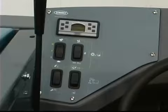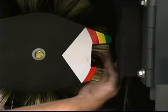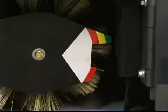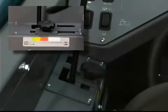To activate the main brush, lower the main brush lever to the working position. To deactivate the main brush, raise the main brush lever to the up and locked position. The main brush idler plug has a brush wear indicator used to determine the amount of main brush remaining — replace the main brush when indicated. To maintain the proper adjustment, observe the main brush indicator and adjust the control lever to match the wear level. To adjust the control lever, loosen the securing knob, move the guide to the proper location and secure the knob.